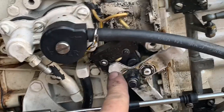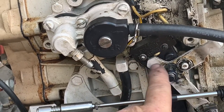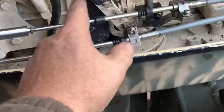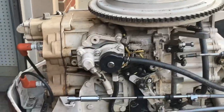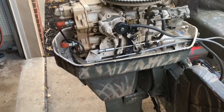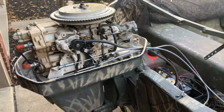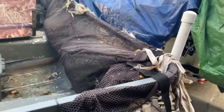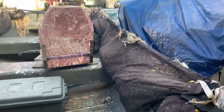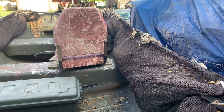Over at the engine you can see this lever is completely off the neutral position and in reverse — that was the problem. We were not getting it to engage fully into reverse. Now that it's happening, once we put the lower unit in, it'll allow that lower unit to fully engage in reverse, and that solves our problem. When I get the impeller in the mail I'll reinstall it, put it back together, and start it up to verify forward and reverse. I've just got to zip-tie all the cables up and it's good to go.